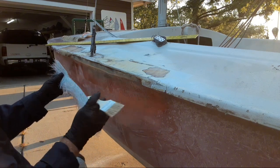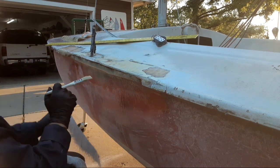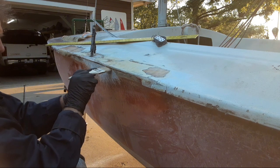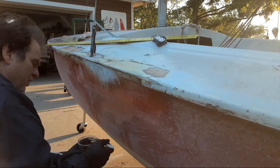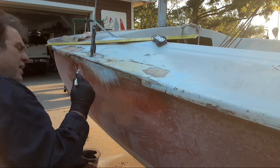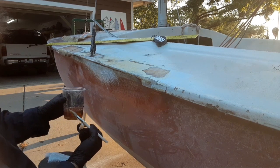I'll take this straight edge, bend it a little, and put it up here. I've got two pieces and I'm looking for this low spot here to here — I'm going to start filling that low spot in. You'll notice I'm just tapping it right along the top line of the clam connection area. If you start putting your fingers up like that you'll get fiberglass through your glove, and then everything you touch will be sticky — I stopped just before I did that. Oftentimes when I take my gloves off there's maybe only one or two drops on them. I load the brush and wipe it off on one side — that keeps me from having it all over the vessel.